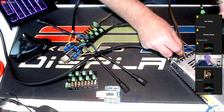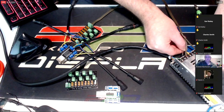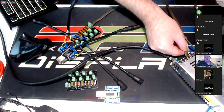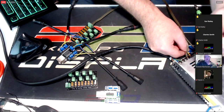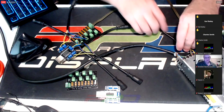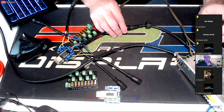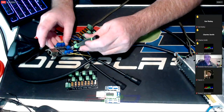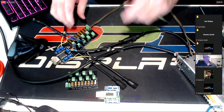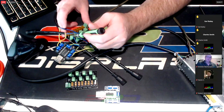Yellow is hot, yellow is hot — and five volts. I think it's easier to do it this way. Wait, I've got those backwards — that would be bad. Do you have reverse polarity protection on the board? I don't explicitly have it built in, but I've done the same thing and can report it did not harm the board over the short amount of time it took me to figure out I was being a knucklehead. I've been doing this 15 years and still make mistakes.